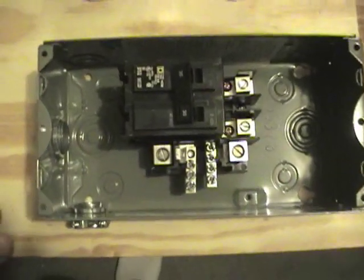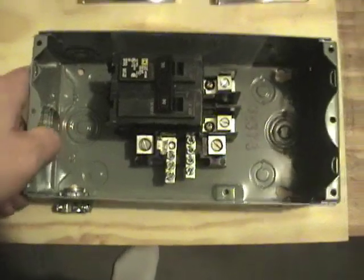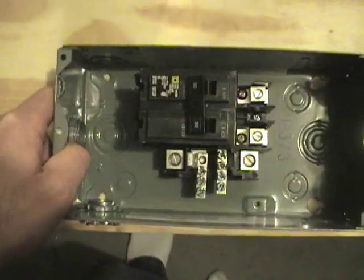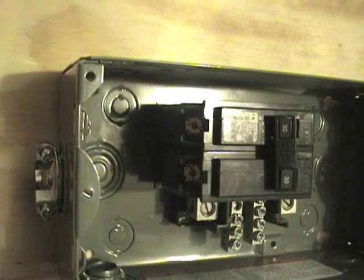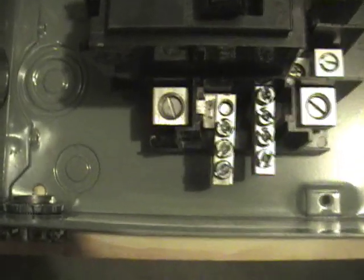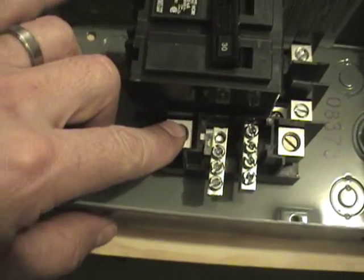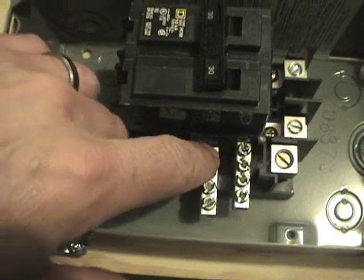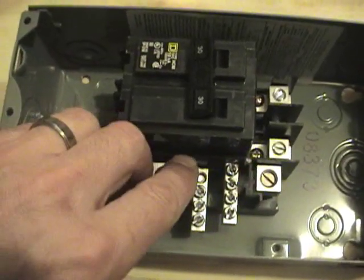What I've done is I've got a junction box, a Square D breaker box, and I've got it set here with the 30 amp double pole. This will be able to take in 240 volts AC. I've redone and modified this area here so that I can split this bar — this neutral terminal bar usually runs across — I split it so I can have a positive and negative lug here.